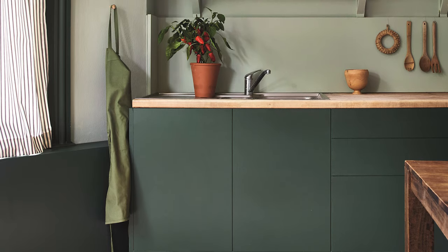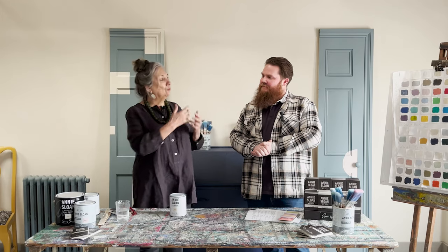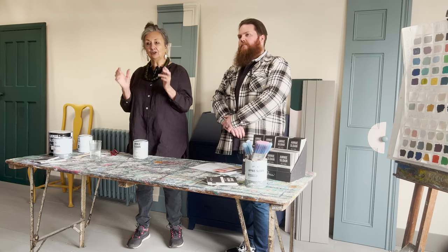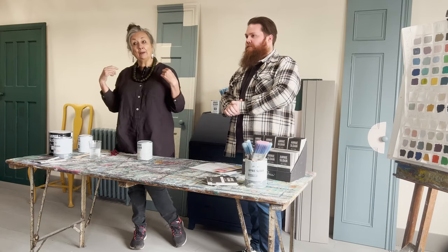Great for kitchens. I think chalk paint is fantastic for kitchens too, but some people want something with really no trouble — they don't want a decorative finish, they just want something robust, strong, and a great colour. The other main attribute of satin paint as against chalk paint: satin is if you just want a simple, flat, perfect finish. If you want to do anything creative — like ombré, blended effects, or texture — you're much better off using chalk paint.